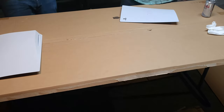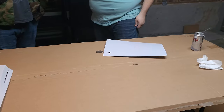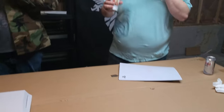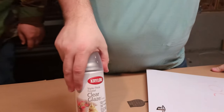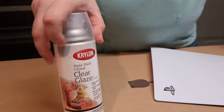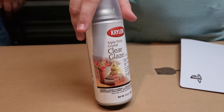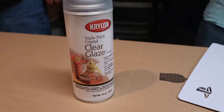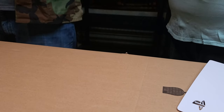The key is to get this good and mixed up. If you want to mix on that a little bit, we'll go in. We'll go ahead and talk about our clear. When you're picking a clear, the important things to remember are: one, your surface. That sounds silly because my surface and my clear is going to be paint. Well, yes. But your different clears will attach differently to the surface. Like a lacquer is really good for wood.